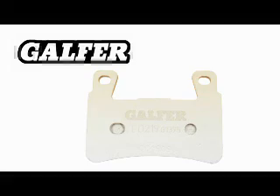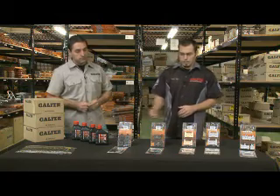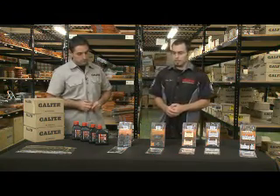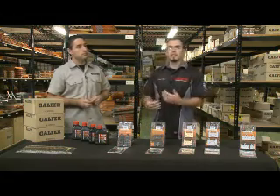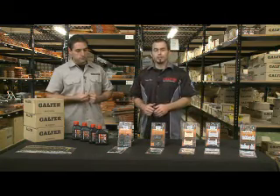The ceramic coating is put in there so that we have some control over how much heat is transferred from the caliper to the brake fluid itself. We also have one other compound — the 1003 compound. That's our race-only compound. The reason we classify it as race-only is because it's a full carbon pad, which means it needs a little bit of heat built up for you to get to the friction rating where you're actually going to feel them grabbing.